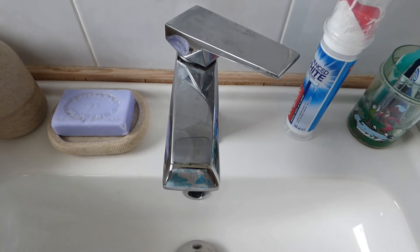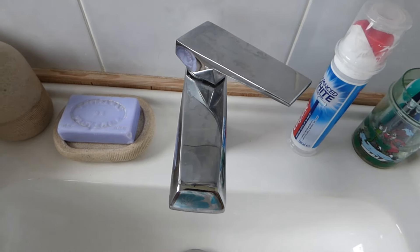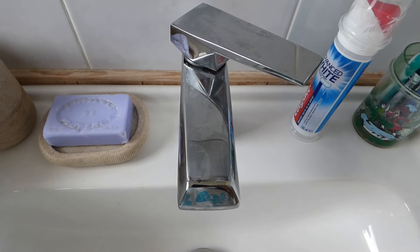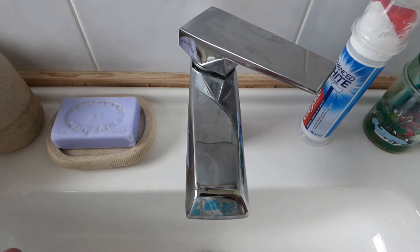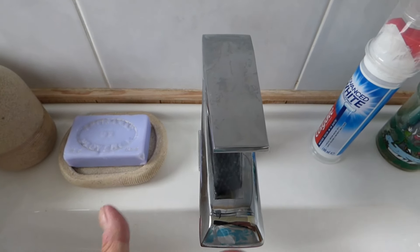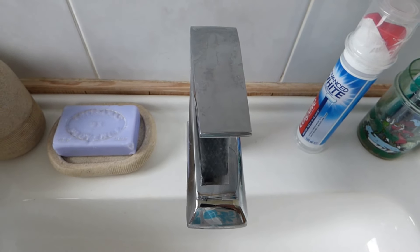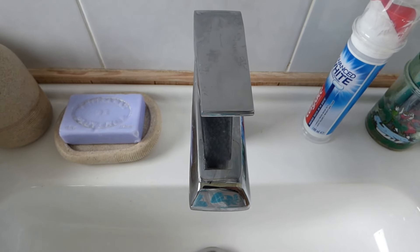Back at our basin tap — if you've got a cold airlock as well as a hot one, so you've got no cold water coming out upstairs either, that would be because it's fed from a roof tank as well. Assuming the tank's been emptied for some reason, you filled it back up and now you've got no cold or hot. You may get the hot water through by doing that trick down below, and if so you'll probably find the basin tap gets it through too. But doing the same thing at the basin won't work if the cold is also fed from the tank, because the pressures will just equalize — that hot pressure will not force the air out. So you're not going to succeed with this one.